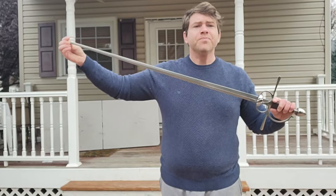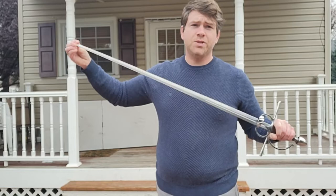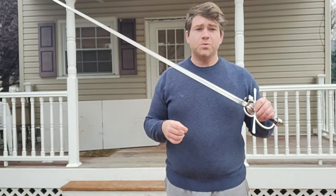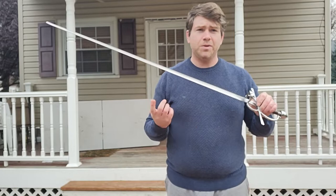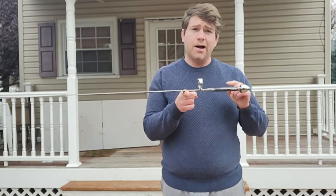The weight I measured at 1.2 kilograms or 2.65 pounds, whereas the website lists it at 1,055 grams, so it is a little bit off. I don't feel like the knuckle bow would add that much, but either way it does not feel like a heavy sword particularly. The other discrepancy was with the point of balance — the website lists it at 14.5 centimeters, and I measured it at 12 centimeters from the grip. That could just be the difference of the knuckle bow's weight, and I'm not really going to complain about the point of balance being moved back a couple of centimeters.